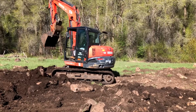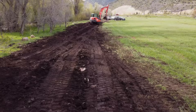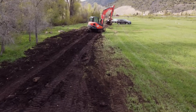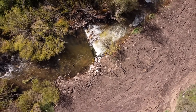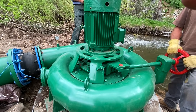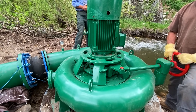The burial of the penstock and electric conduit uncovers these stones, and dressing the trench with an excavator before reseeding the pasture will over time heal and hide the disturbance to the meadow. With the dressing of the ground nearly completed and the penstock full with water, it is time to start the Francis turbine. This regulated start-up is to set the output capacity at the appropriate level.